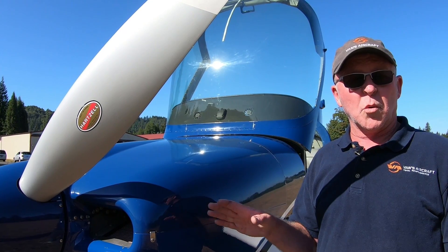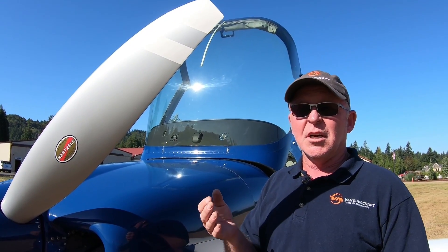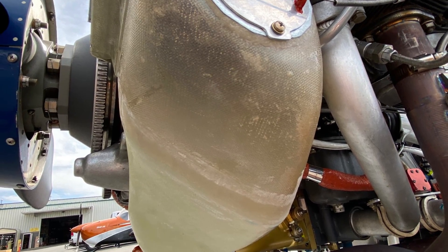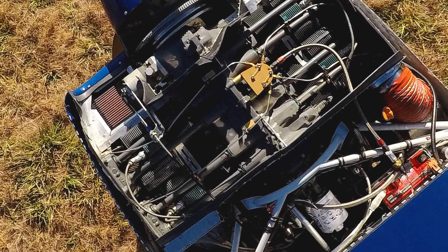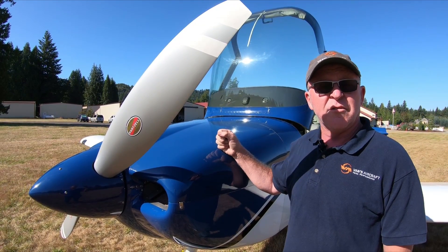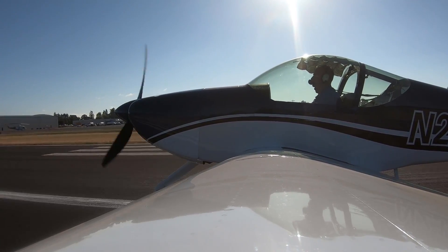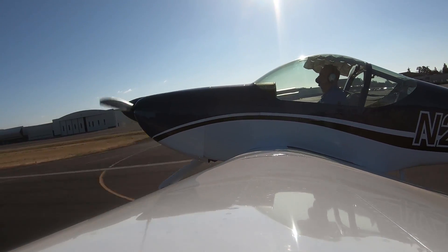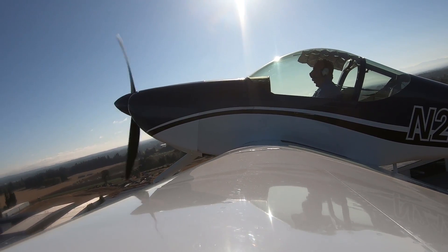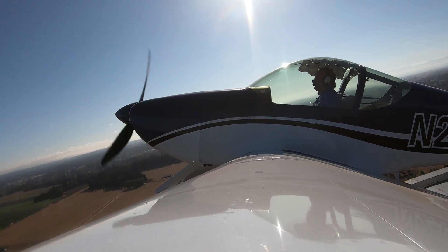Not only are we making more power with this engine and taking advantage of it by tuning the exhaust to get all that horsepower out, it's also a lighter engine. A billet oil pump, cold air induction, magnesium sump, and taking the accessory pad and all the gears off the back of the engine and putting a blank on there — all that takes around 9 to 10 pounds off the engine, which is a pretty meaningful weight reduction on the nose of the airplane, especially combined with the extra power. The airplane configured with the new engine takes off faster, takes off shorter, climbs faster — up to a couple hundred feet per minute more. We've been flying it the last couple of days and we're seeing climb rates pushing 2,000 feet per minute with a couple of people and a lot of fuel in the airplane, and that's pretty impressive on a hot day. It's just a higher performing airplane overall.